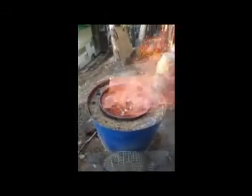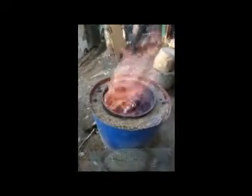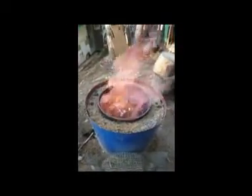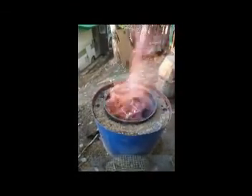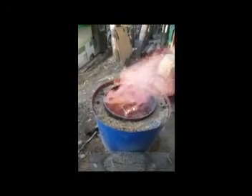I'm on my third load of aluminum and my second load of added hardwood lump charcoal, and it's going like the Dickens. It's molten — it's red down there at the bottom of the crucible — and the aluminum is melting very slowly. I was doing this without the fan at all, and now that the temp is pretty close to where we want it, I kicked it up high to hopefully melt this stuff faster and get us to a high heat for the pour.